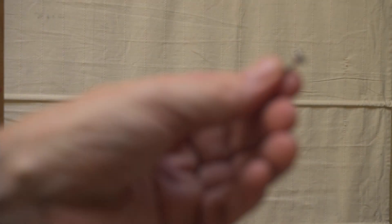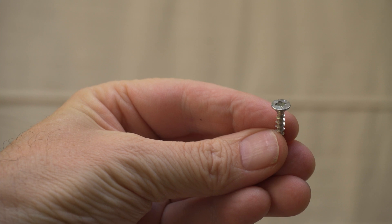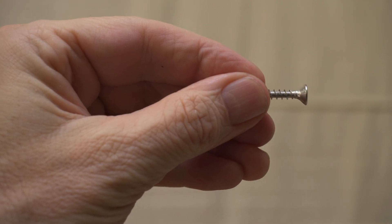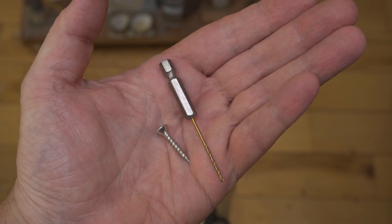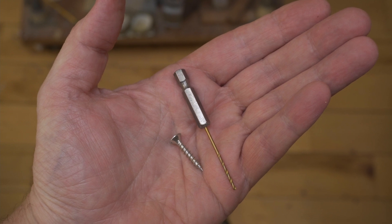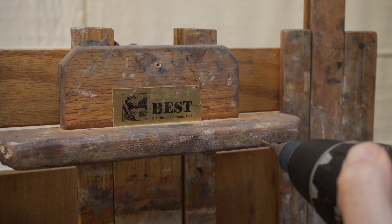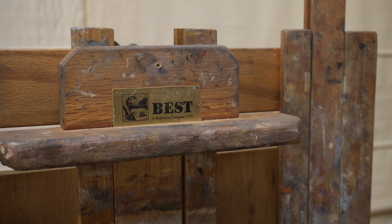But I think I've found a cheap and easy solution to this, which will work on almost any easel that has wooden holders. All that's needed are some flathead wood screws — either half an inch, three-quarters of an inch, something like that — and you probably already have these in your garage or can get them easily at the hardware store. To install these you'll probably want to make a pilot hole with a very thin drill bit. The idea is just to put these screws in the front face of the canvas holders. You can position these wherever you like, and of course it's easy to change your mind.